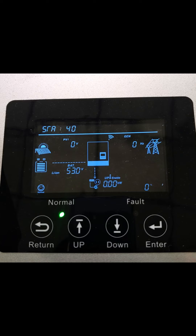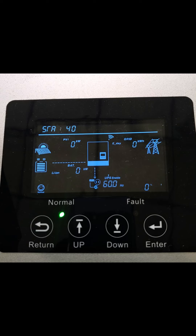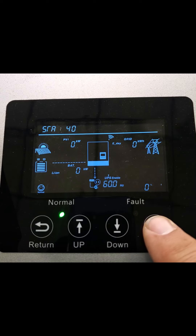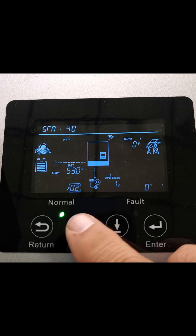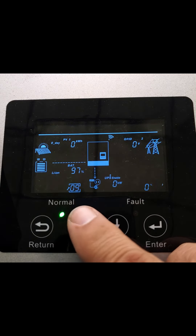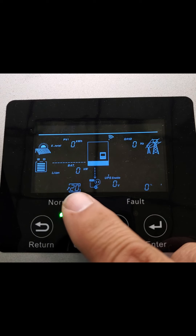Right here, we've got the screen set up where we're noticing we're only getting about one volt — it just kind of goes back and forth — and we get 60 hertz. So we'll go and correct that by going to setting number 20. Setting 20 is where you have the economy mode and your power saving modes.